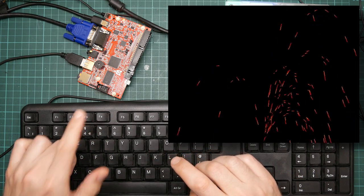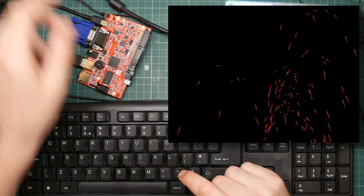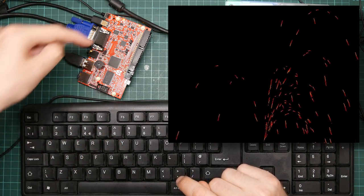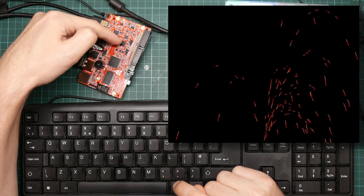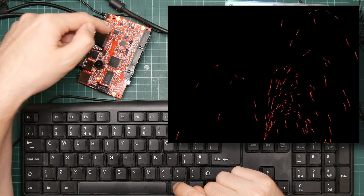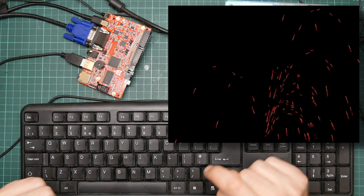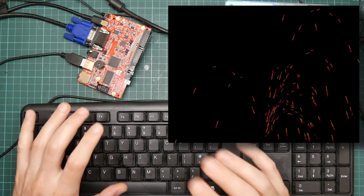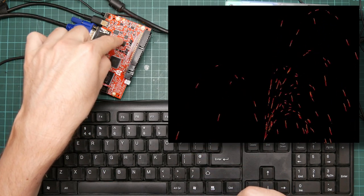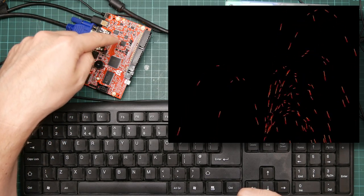The way this machine actually works is the EZ80 is basically a headless EZ80 machine. It's connected to a terminal via a UART, that terminal being the ESP32. The ESP32 takes care of drawing things on the screen. The EZ80 does not actually have access to the video memory — all drawing happens through sending byte sequences across the UART. The ESP32 here is called the VDP in Agon terminology: Visual Display Processor. It understands the same set of codes that ACORN used.